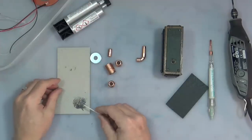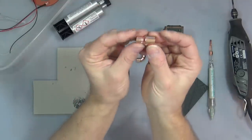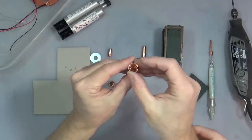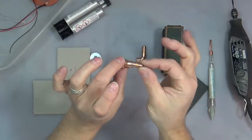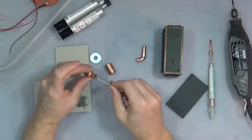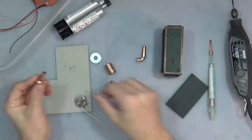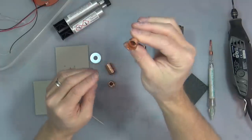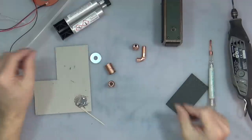We need a little bit of glue in there so we can put the bend in — that will then set, then we can pop it into the box. What you must do is blow air through it just to clear a channel, otherwise you'll block it and never get the wires through. Then we're going to glue the reducer — this is a 15 to 8 millimeter copper reducer — from your hardware store or plumber's merchant. And then a small piece of eight millimeter pipe again.